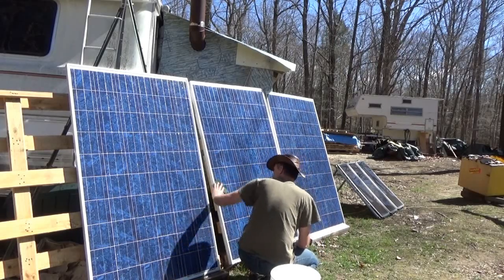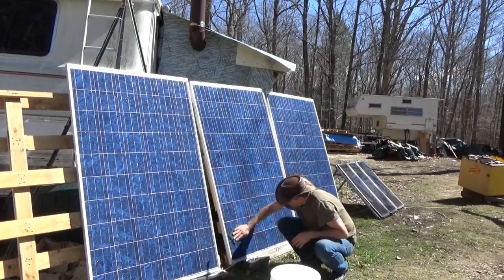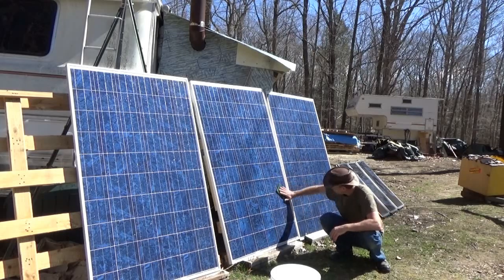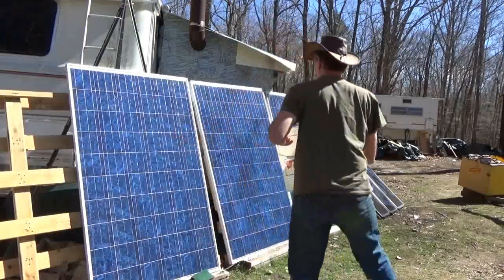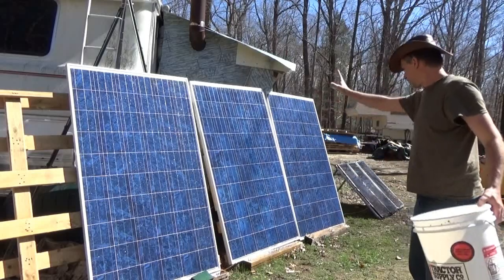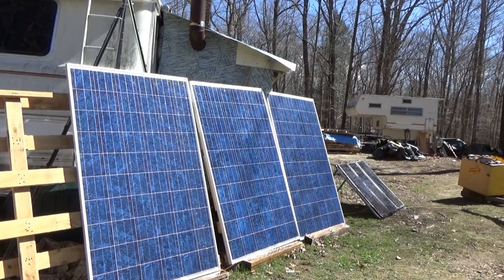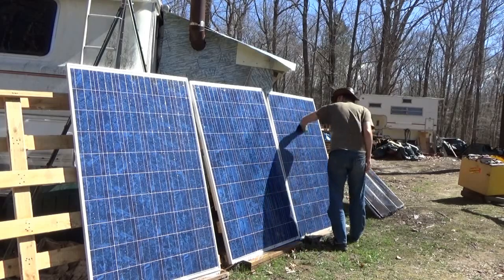You've got to work faster because the solar panels are hot in the sun — they heat up really well and really quickly. Just keep that cleaning pad or sponge moving, then grab a bit of water and rinse. I want to do that twice. I see it streaming down every bit of the solar panel, so we're good. I just want to make sure it's streaming down thoroughly off the solar panels — that way I know I hit every bit of the panel with the rinse.